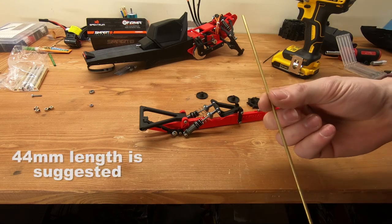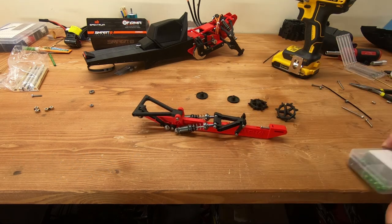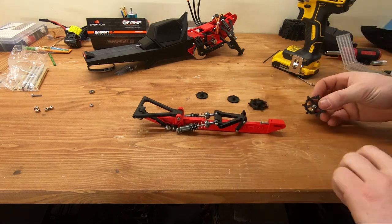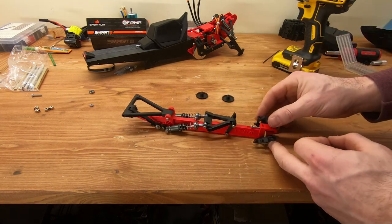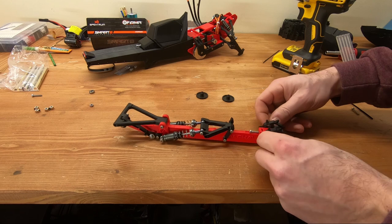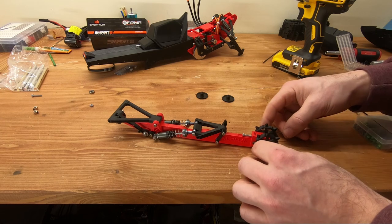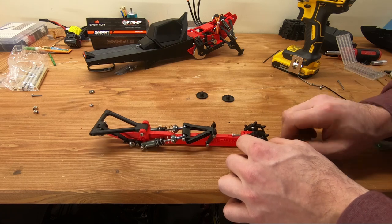On the back we're using a brass shaft. I put tighter tolerances on the rear so it will be a bit more difficult to install, but at least it won't spin and make a groove. I'm also using a couple of washers between the wheels to prevent wearing through the plastic too quickly — I suggest you do the same, using M3 stainless washers. I also now offer a set of rear wheels that have holes for bearings to be installed — same 3x7x3 bearings as the tensioner, two per wheel. Then install Dubro collars and you'll have rear working idler wheels.